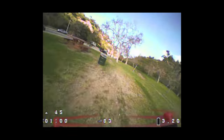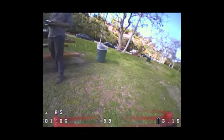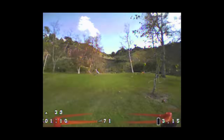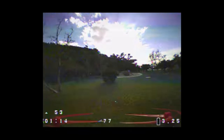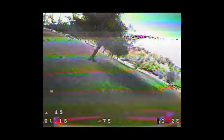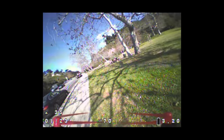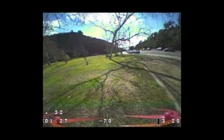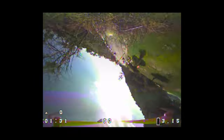As you can see, the performance of this thing is kind of night and day compared to the Trash Can, and that's because it's set up like a real quad. This is running the previous Mobula board, not a Trash Can board, so it doesn't have an F3 processor. It's running at 4K/4K, not 8K/8K. But it moves pretty darn nicely, and I think the Trash Can is going to be a really excellent transition onto this frame.